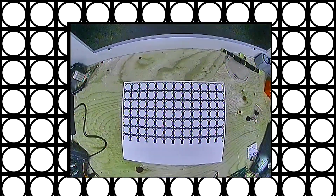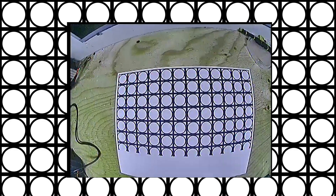I made a custom image with distributed equally sized squares and circles to test how this camera distorts perspective over the surface of the lens. Objects in the center 50% of the screen have little warping, but after that you can observe the fisheye of the lens fold the corners out. The pattern and warping appear to be even, but the vertical fisheye is much less than the horizontal. This is all very normal.